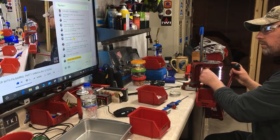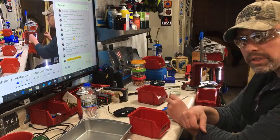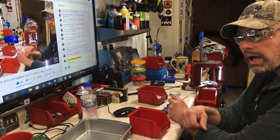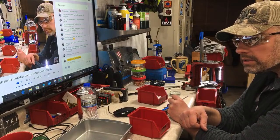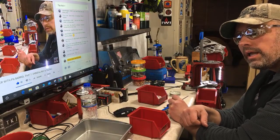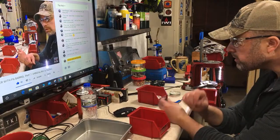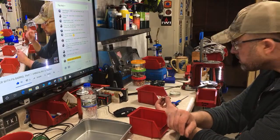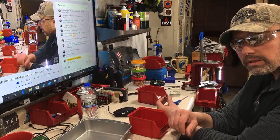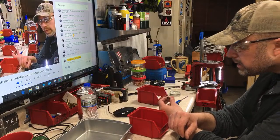Now, remember that one piece was 1.460, do you remember that? So 1.460, and I don't think I bumped the headspace gauge because all I did is I touched that shell plate, maybe gave it a quarter of a turn. And you haven't watched me measure this yet, have you? No, you haven't. And I'm almost gonna guarantee that that headspace grew. If you don't bump the headspace, that headspace is most likely going to grow. The brass needs to go somewhere.